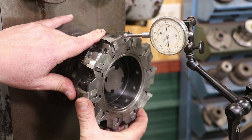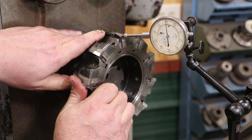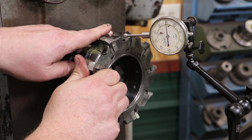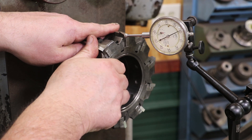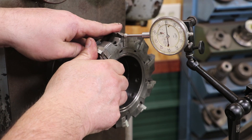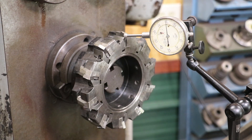I've got a tip on here that's kind of a ball shape so that it will roll up over these cutters as they come around. I've got my zero set about where zero is going to be. That one's about four thousandths — actually, that one's zero. They're not all uniform. That one's right on zero, that one's about a thou below, that one's right on or right about a thou. So just looking at this I've already got about five thousandths variance from one tooth to the other right now. I'm honestly hoping I can do better than that, but really, that may not be bad for the machining we're going to do.